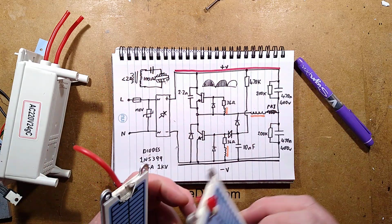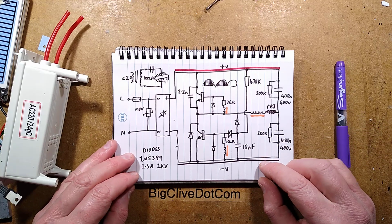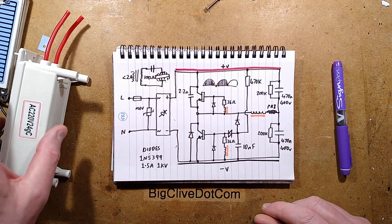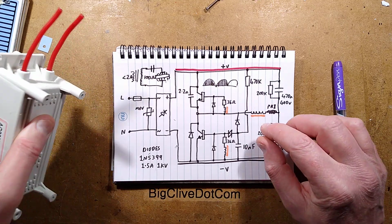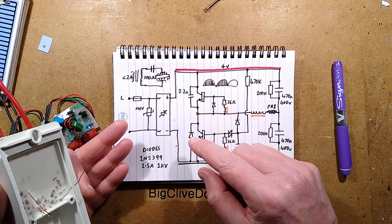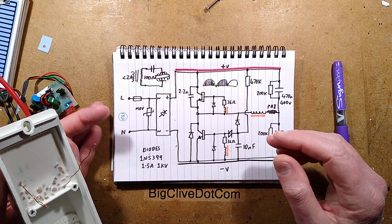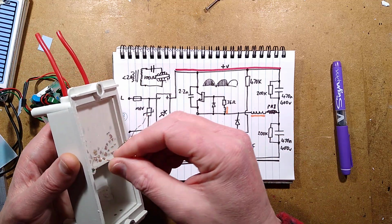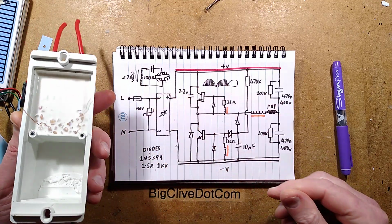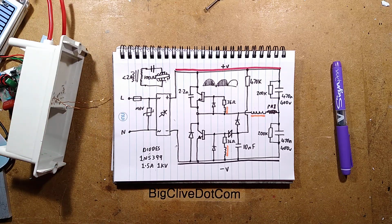Very interesting. Much simpler circuitry than I was expecting, but also I'm impressed that it is sort of high frequency AC it's putting out. It's not that horrible pulsed thyristor one that just basically on each half wave charged a capacitor up and then dumped it once it had reached a certain threshold. This one is much more efficient and more practical. Probably is based on the neon technology. But there we go. Interesting stuff. Well worth taking apart.